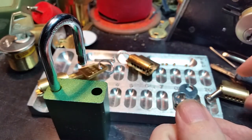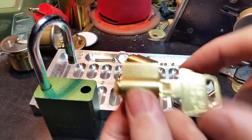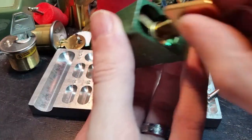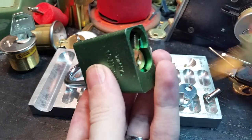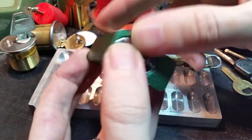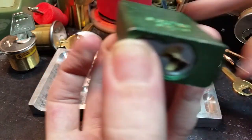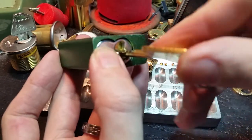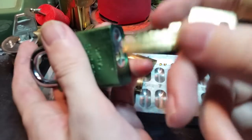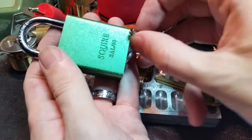But what can we do beyond that? Because that five-pin American Lock core with the Master Lock keyway fits, why not a six-pin American Lock core? That will still fit in there. This one is also from my parts bin, so it's not actually fully combinated, but there it is — inserted, and the shackle is locked up. Key goes in and it functions just fine. At six pins, that's going to be quite a bit more pick-resistant than either of those five-pin cores.